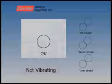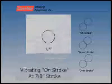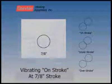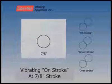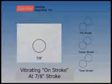The peak to peak motion or stroke on the operating unit can be determined with the stroke plate. When the unit is put into operation, the stroke plate looks like this. As the motion changes direction, the circle instantaneously stops, so the circle is visible at the top and bottom peaks of movement. The flashing red arrow shows the point where the circles intersect.